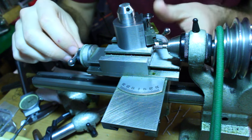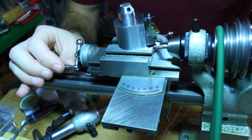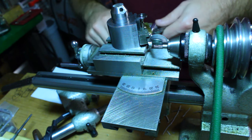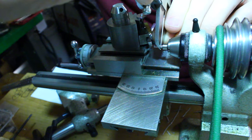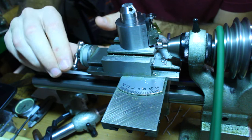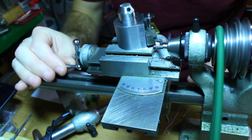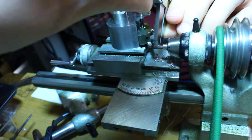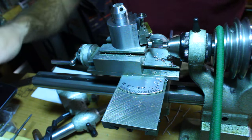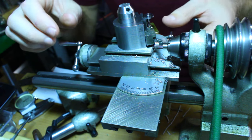We'll start with a pair of Coach sunglasses that has one arm screw missing. We're using some scrap stainless steel from an old printer. To start with, the stock will be turned down to the outer diameter of the screw head. With the work turned to the diameter of the screw head, we need to now turn the diameter for the threads.